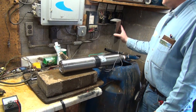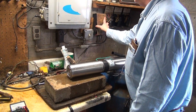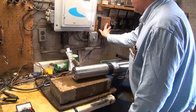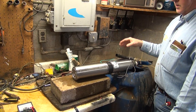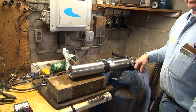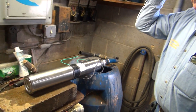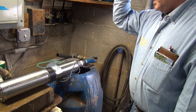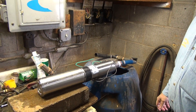The only difference I can see is when you start — you get that juice down that one red wire. The red wire is the start winding, and the relay just gives it a start to get it going, then drops out, and you're running on your 230-volt power on the two wires. You need that start winding. We'll go ahead and show them down below the other pump that we've torn apart.